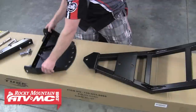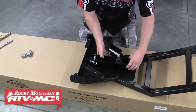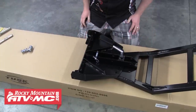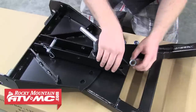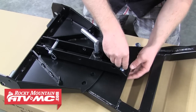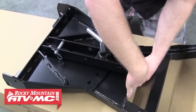With the push tube sitting on a flat surface, position the push pivot onto the push tube making sure to line up the two holes in each piece. Next, sit the blade angle bracket on top of the push pivot and push tube, making sure the pin slides into the holes. Find the M16 by 40 millimeter bolt with the spacer on it, disassemble it, and position the spacer between the blade angle bracket and the push tube. Slide the bolt down through all three pieces, then slide the washer and thread the nut onto the back side. We're going to leave this loose for now.